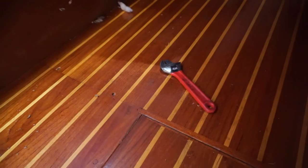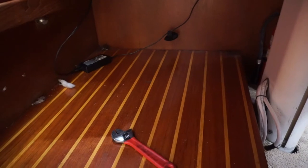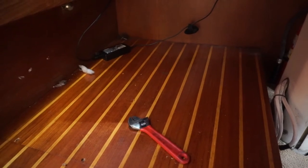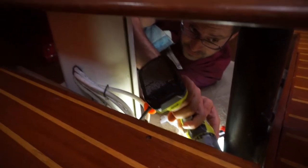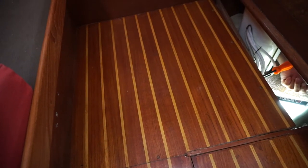Right now I am taking apart this panel here, which is just on the other side of the mast. I tried to do an easy-out to break it up - I've never done this before to pull bungs out. So now I'm using a one-eighth and one-quarter inch drill bit to break up the bungs so I can get the screws out. We're trying to get this panel out of the floor so that once we get the mast out, we can see how bad the stringer is underneath.